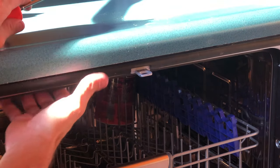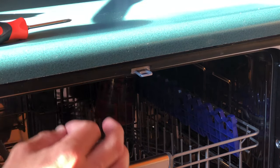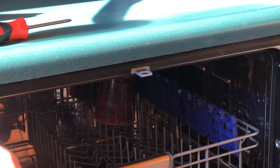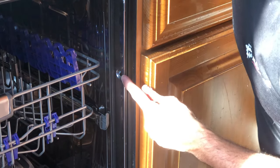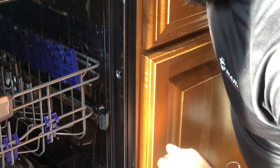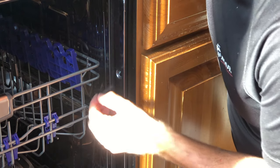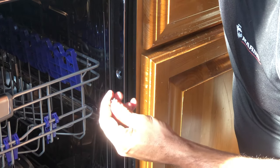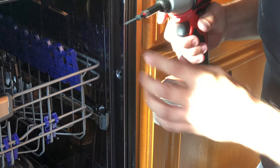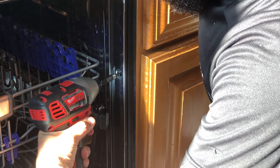Once you've got that back into place you can see that it is nice and rigid. If you want an extra precautionary measure or some extra hold, there are some screws here on the side — let me show you these. I've already removed the little plastic cover here, which exposes a little joint where you can mount a screw. This is going to mount directly into the side of your cabinet and will keep it from falling out on both sides — a little extra level of precaution. If you're having trouble with your brackets, you can simply sink a screw into your cabinet here on the left and right.